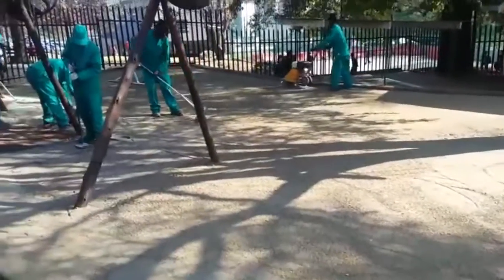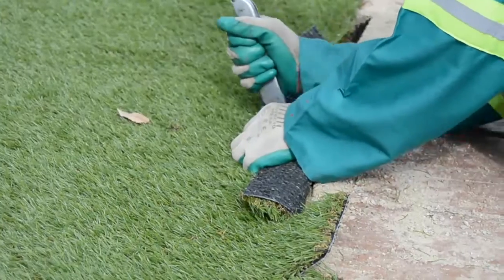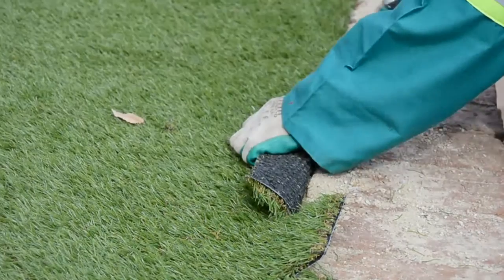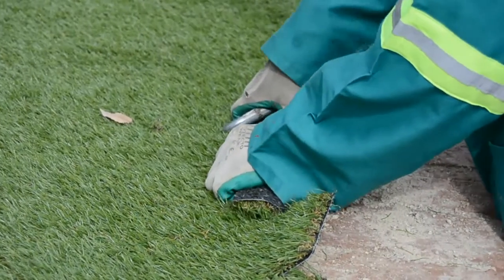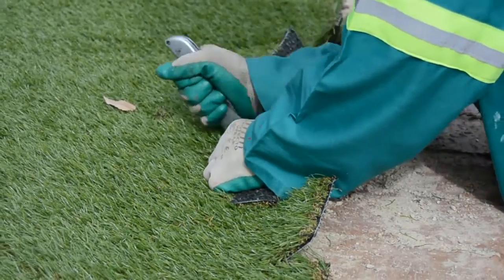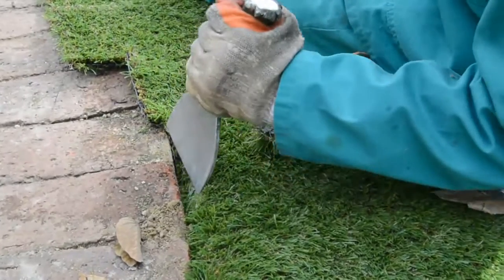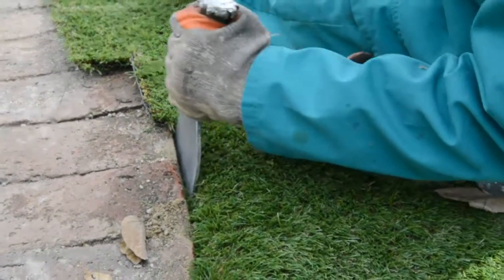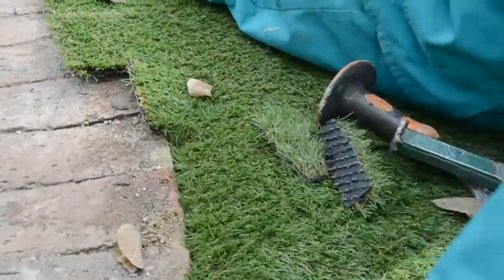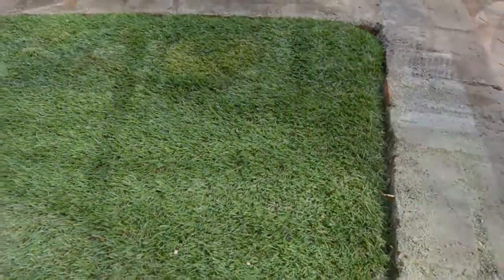This will help rainwater drain away quickly without disturbing the dirt below. When this is done, we compact the surface. We lay down the grass and join the artificial grass mats using a wide tape and strong adhesive. Once the edges are pushed in, the dirt and crusher sand will help to keep the edges locked down. We also spread a layer of silica sand on top and brush it into the pile. This weighs down the artificial grass and prevents any movement.